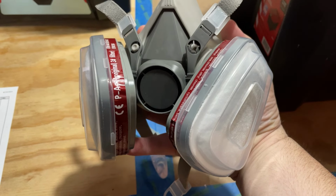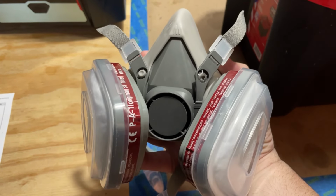If we're talking about safety, then that brings us over to the next thing. We recommend getting some type of mask or respirator. I use the word respirator and people instantly freak out. However, there are fumes that are going to come from the 3D print and the resin, and it's also going to come from the alcohol or cleaning solution that you have. Now, we were able to find one that works pretty well that's only around $20. The other good thing is if you're going to do any type of post-processing work or sanding, you also want to have some type of protection for your lungs. So a respirator also helps out really well for that as well.